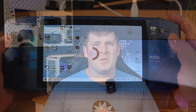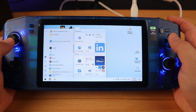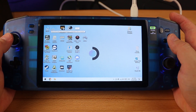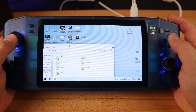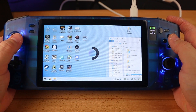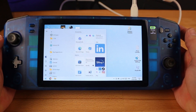My second complaint from the original design is the display. I've been pretty unhappy with the quality of the screen overall since the beginning of the project. The IPS panel I ended up settling on is okay, but the greying out of the sides when it first starts up bothers me, and the gap between the display and the front glass seems to make reflections pretty bad. Not to mention that ideally the resolution could be a bit higher. I also never managed to get touch working, which would make Windows easier to work with.